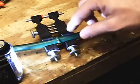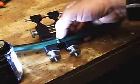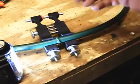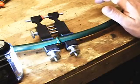Once it's been in the clamp for 2 minutes, we'll take it out and then we'll clean it up around the actual union here, the joint where we welded it together. After we do that, we will not put it on the machine for another 10 minutes. But this one's going to be a spare, so I'm just going to trim it up and just put it back on the rack. Next time somebody comes in, the belt breaks, they'll have an extra one to put on.